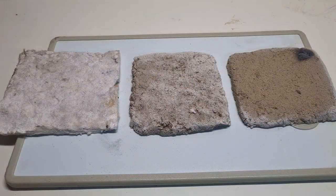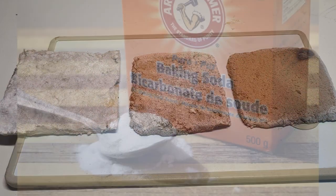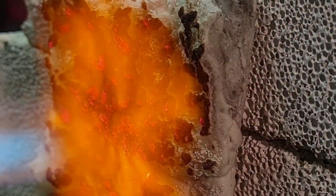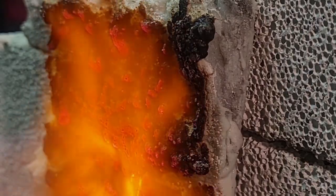But let's go back to fireproofing materials. In this video, I will make and demonstrate some materials which are really easy to make and have the potential to be good for fireproofing. The basic fire retardant materials I will use are sodium bicarbonate or baking soda and cornstarch. Sodium bicarbonate is really good because it produces carbon dioxide and water when heated. When you heat cornstarch, it forms a carbon foam to protect the material below.